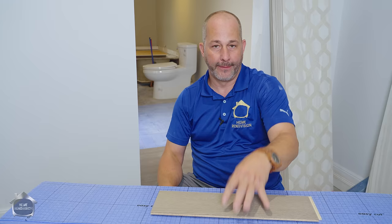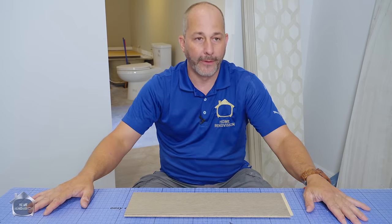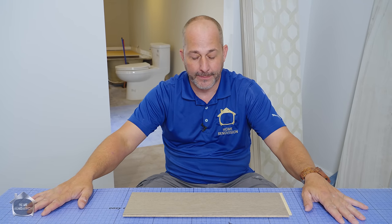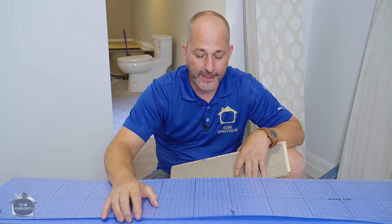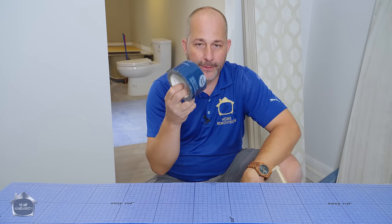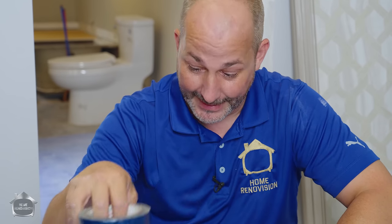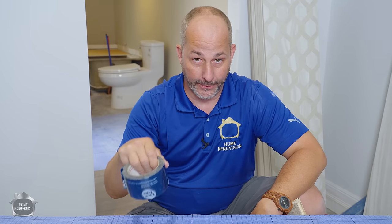There are also a lot of folks doing work in basements, or with old houses that are slab on grade built before they used vapor barrier underneath the concrete. This product also acts as a vapor barrier — moisture transmission through it is so low it qualifies. You just use blue tape to tape all the seams and you've got a vapor barrier. So if you're putting it in your basement without a subfloor, you can get away with it. It has a thermal rating, so you get a thermal break as well. Tape the seams for older houses; for newer construction you don't need the tape — just put it right on the concrete.